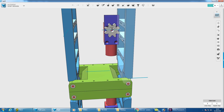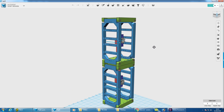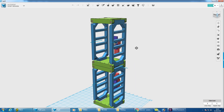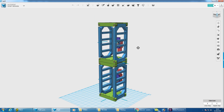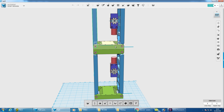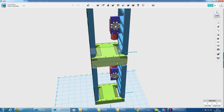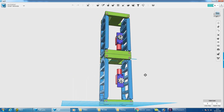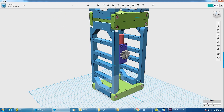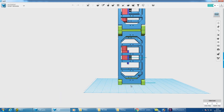The motors in here — I haven't got the mounts yet — but I've left lots of holes to mount them and the gear on the other side which that motor runs against. I've tried to make these parts as repeatable and as generic as possible, so the fronts and backs of the legs are in fact the same parts, and so are the tops and bottoms. We're going to print all these out lots of times. They can be attached back to back to make the double-jointed knee. I may reprint the tops and bottoms to make the hip and ankle, or just screw the extra hinge joints onto those.